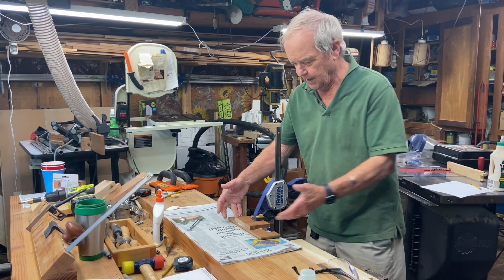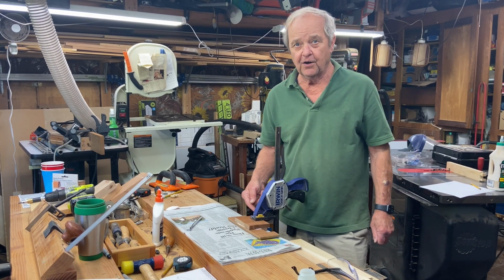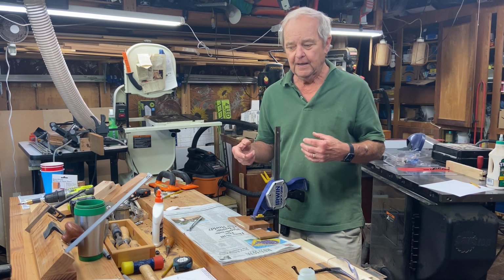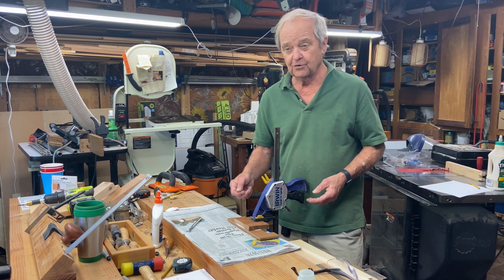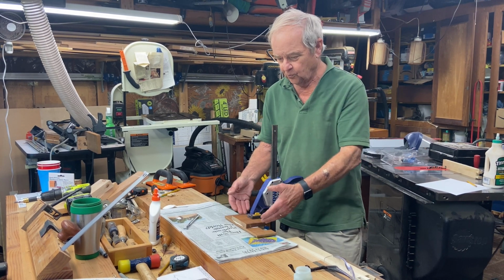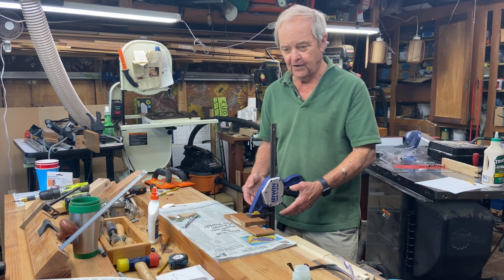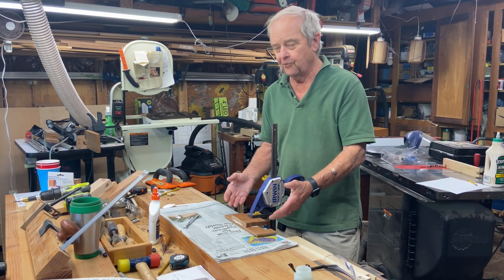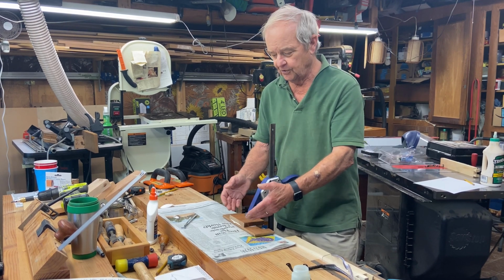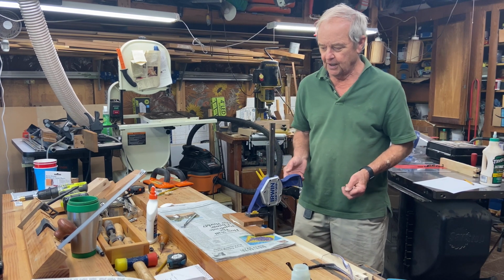and then you can take a towel and wipe this glue off. If you leave the glue there, you'll have some difficulty removing it after the glue dries. You'll have to scrape it off or cut it off. Whereas now you can just wipe it off. But you'll find it's under pressure, and if I wipe that off and leave, 3 or 4 minutes later, more is going to have squeezed out. So that's an iterative process until it's been sitting like this for some reasonable period of time.